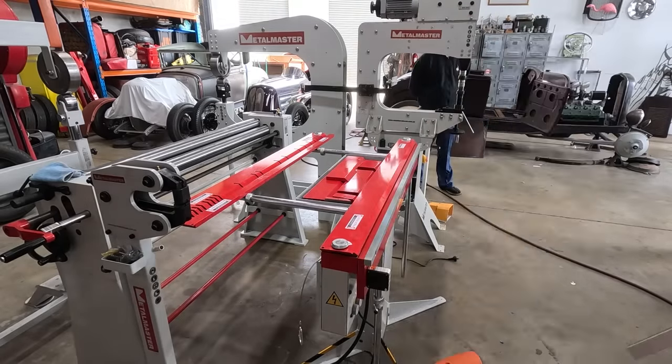So right now, I'm just gonna probably pop this dolly out, because I need the stretch in here. That flange has to go flat in that spot. So I'll probably maybe even just use this. Try and get it out of there temporarily. Kind of work it flat. I know it looks like you're just kind of messing it all up, but you got to do it. So I'm going to go step on the stretcher, get a little bit into there. We'll put that flange back and see if we're all right.